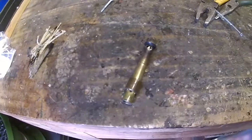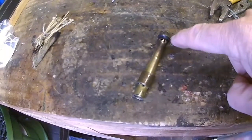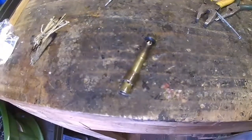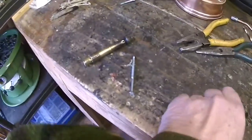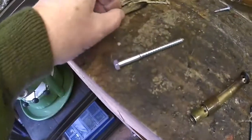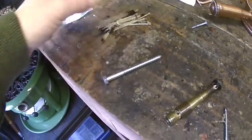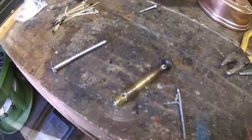So that's what I'm doing, replacing the wick and unclogging the jets because they're full of carbon. Now, to get the wick material out of here was quite a job, and what I had to do is put a screw up inside it like that and pull it out. Absolutely grotty. So hopefully with a new wick in it, it'll burn much better and cleaner.